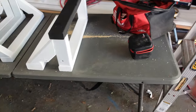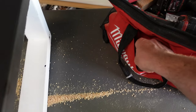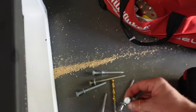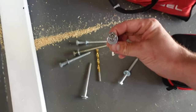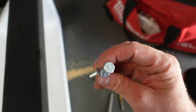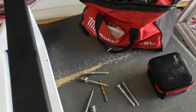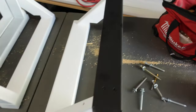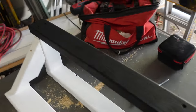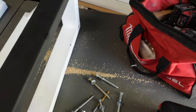Now we need to screw these in. I managed to scavenge some stuff from work — I always scavenge bolts. The only annoying thing about this is none of these are actually matching; they're all different heads. And they're not galvanized or anything, so they are susceptible to the moisture. But up under here they shouldn't really get wet at all. It's only the stuff near the ground that I really worry too much about getting galvanized bolts.